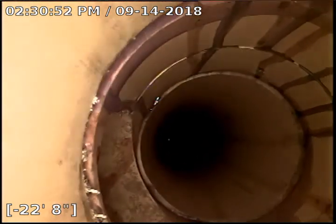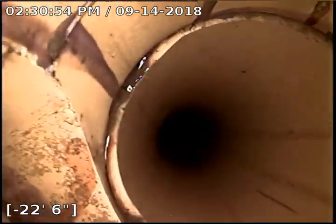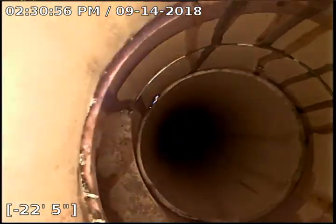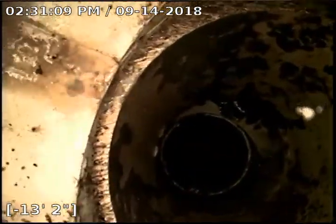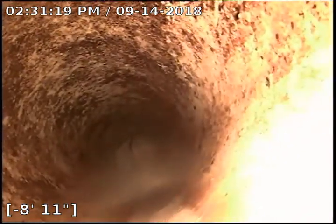All right, so here's our 3-inch stack. It's also known as the main stack. That's a revent. That's just where they didn't want to make another roof penetration. So they just tied into this 3-inch vent, perfectly fine. That's going to be a sink. That's tying in, and we're gonna pop right into, there we go.